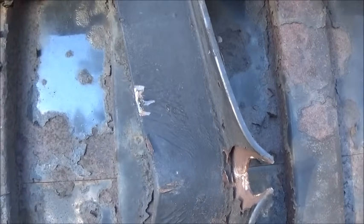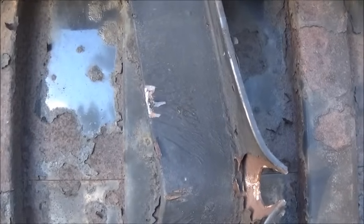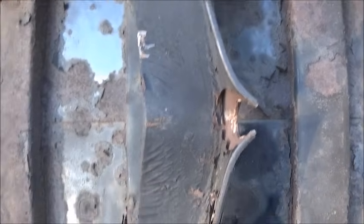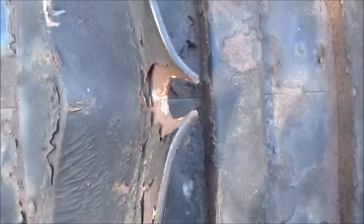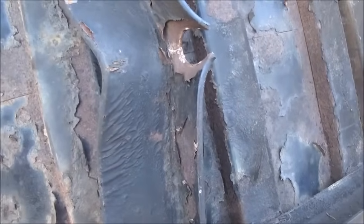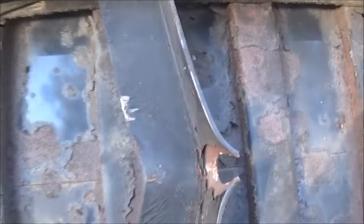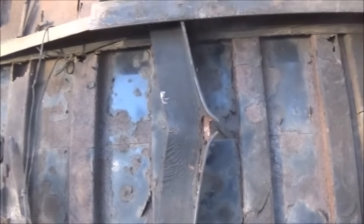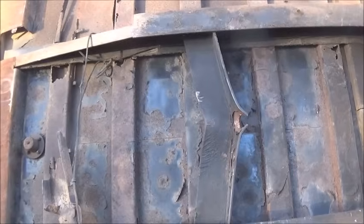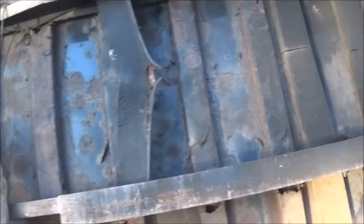I think there was a car on the back. It knocked the car forward, but it probably pushed back on the bed because it bent it down, and I guess it forced it back. So that's a healthy piece, and that's why I was worried about my hydraulic cylinder. I've already ran my cylinder entirely out and back in, and it's in good shape, and this is no problem at all to fix. We'll just build a new one, put it in with a new hole, maybe support it around the shaft a little better than what it was, and that's not a problem. So cross members, no issue there.